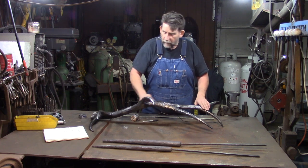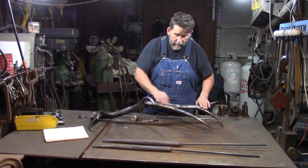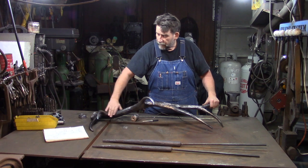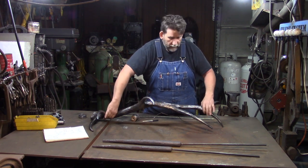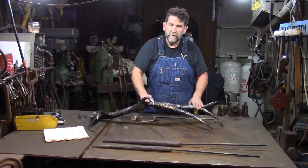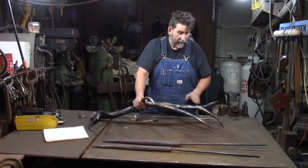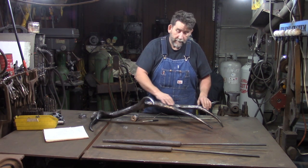So once you get that welded up for what I call the first pass, and you get your webs and everything in there, then you take a grinder, a 4.5-inch grinder, and you grind that down and you blend it. Okay, you take some time and you blend it on all sides. Okay, once you get that blended the first time, you're going to have craters, you're going to have places you're not happy with. So what you want to do after that is you want to fill those in